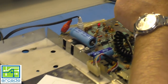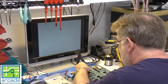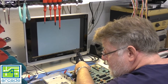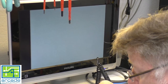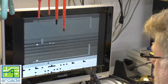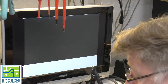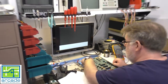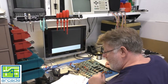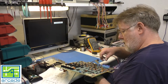Looking for dead gates but not finding any. Got it down to where we're looking at pin 10 on the 74LS195, just past the DRAM - we've got no signal there. But if I short this over to pin 9 next to it, we can see some elements of graphics on the screen. I replaced the 74LS04 at E4 and put it in a socket, but we still don't have any outputs from it. So I've got to look at the resistors and capacitors in that circuit to figure out where the dot clock is dying.